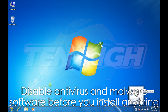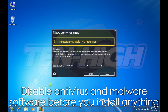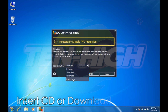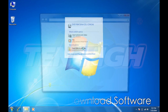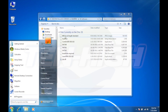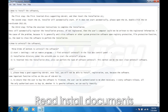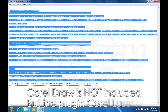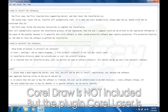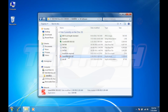Now let's take a look at the software installation. Before we begin, we want to disable any antivirus or malware software that could interfere with the script files for the installation. The software provided includes LaserDraw, which can be used to etch and cut. The preferred method for etching and cutting is CorelDraw. Please be sure to read the install required document. Although CorelDraw is not included, Corel Laser is — a plug-in which can be used inside CorelDraw 12 on Windows 7 or Corel X8 on Windows 10.